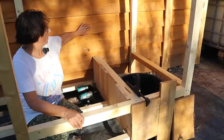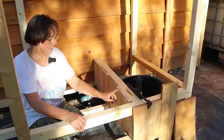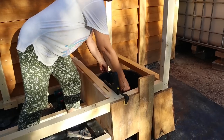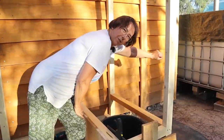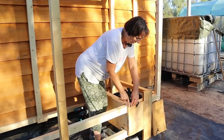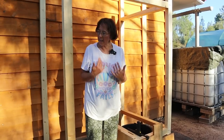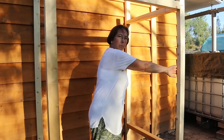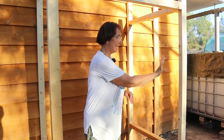What we were working on today was to block in the toilet area — we're making a box basically, and this is the next section we're going to work on. We've used the ends of these long timbers from the garden house and fixed them all in to block a box which will house our big bucket, and then a couple of doors at the back will open up so you can remove the bucket from the back. I've got my three planks worked out that will fit this section — they just need cutting down and screwing in.